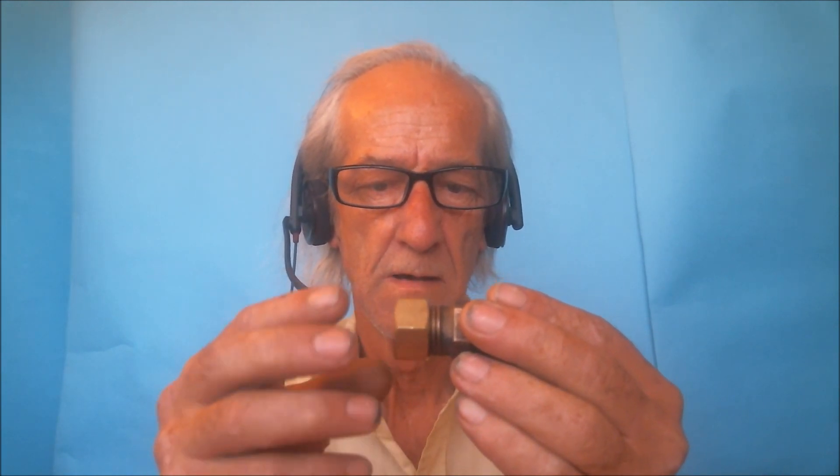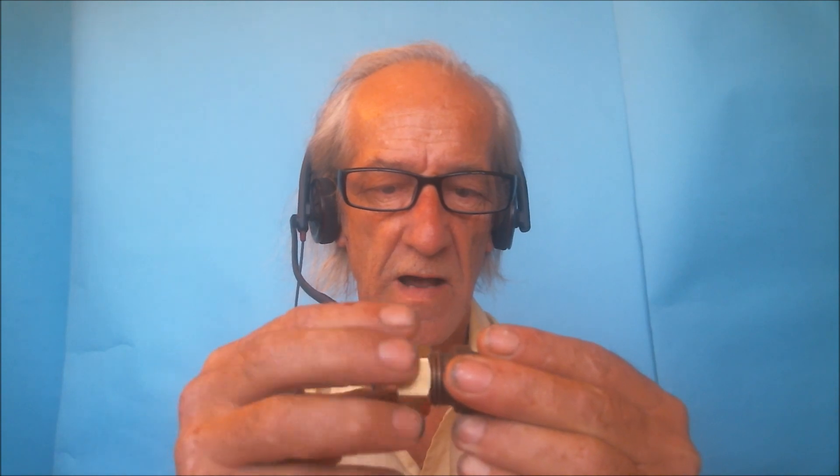You shouldn't just use PTFE tape on everything that has a thread. Not all threaded joints need PTFE tape, as I explained in my video on kinds of joints in gas systems — you'll find the link in the card above and in the description. We only use PTFE tape in joints where a male thread is screwed into a female threaded fitting, and only in those joints that are accessible to inspection — not buried underground or in walls. Threaded joints that work by compression shouldn't have sealing tape, because the tape will affect the ability of the compression system to work and seal the joint.